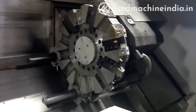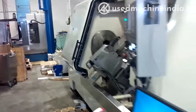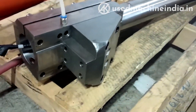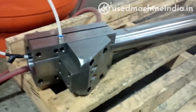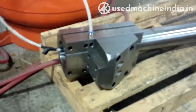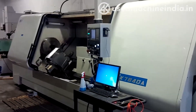The turret uses the larger inch-and-a-quarter tool holders for more rigidity. And we also have a custom long boring bar attachment, which I'll show you over here right now. This is the long boring bar you see from the pictures. It has a double face mounting procedure to make it extremely rigid. The tool holder may or may not be included — the bar is not, but the tool holder is probably included with the machine. So this is the Shinri Boxway machine.